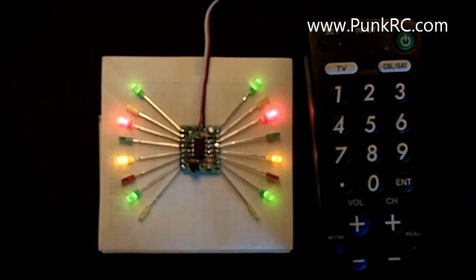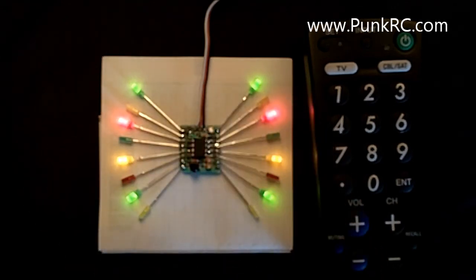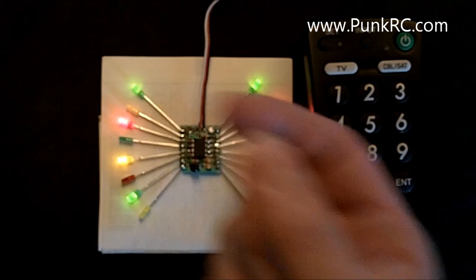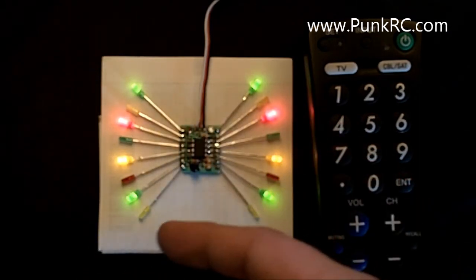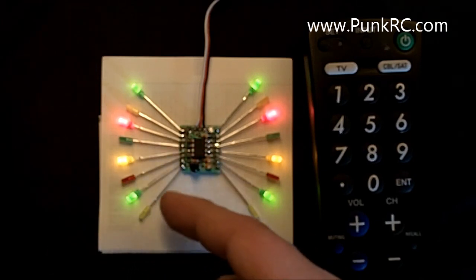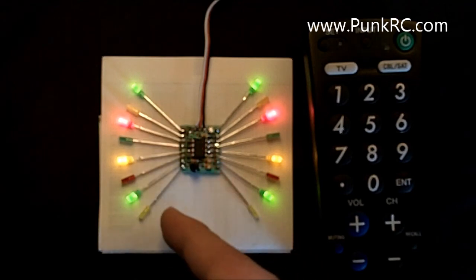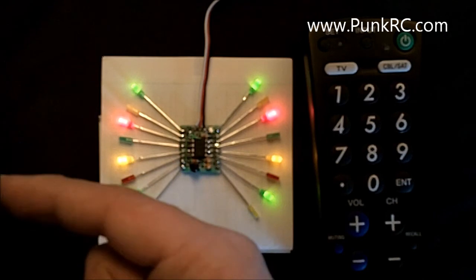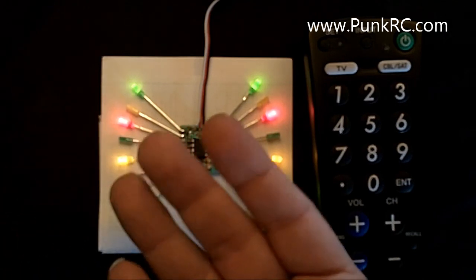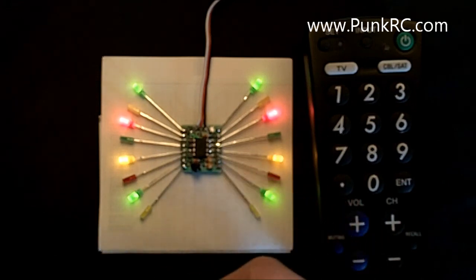Anyway, as you're wiring it, some considerations. These are important. These will help you out. Left and right, you'll want to do opposite sides of your plane where applicable, like for your different wings and your strobes, do left strobe, right strobe. Another thing is all the positives on the top of the board, or if you're using the pin headers or the screw headers, they'll be labeled. All the positives are the same. So if you have a wing and you have 4 lights on the wing, you can run 1 positive, and then coming back you'll run 4 of the negative LED wires into the bottom of the board. So that's basically how it's set up.